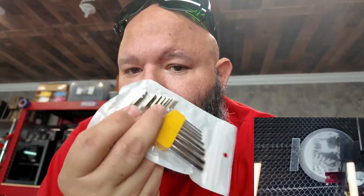There are rail guards you need to remove — they're documented in the manual. Don't lose the focus tool; I made a bracket to keep it on the side. It comes with a couple other maintenance tools. You will need to get a water chiller and fume extraction — I highly recommend it. The exhaust is five inches, so check my adapters or find a five-inch to four- or six-inch adapter at Ace Hardware.